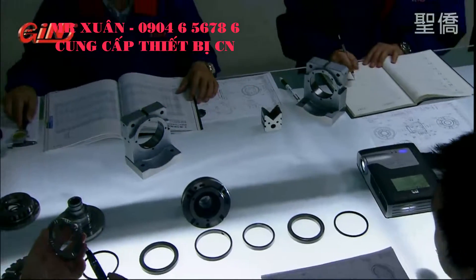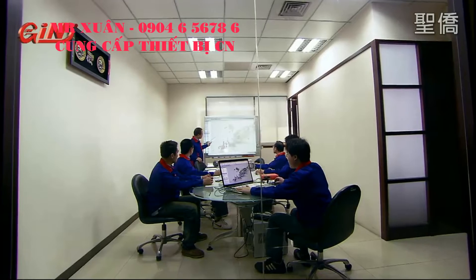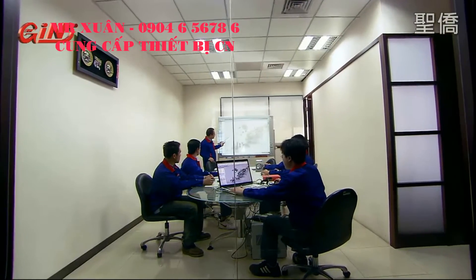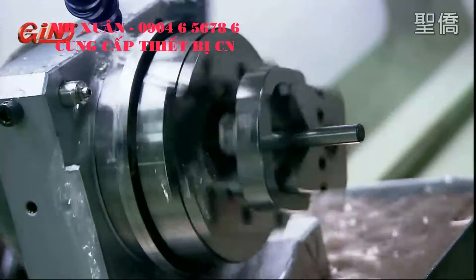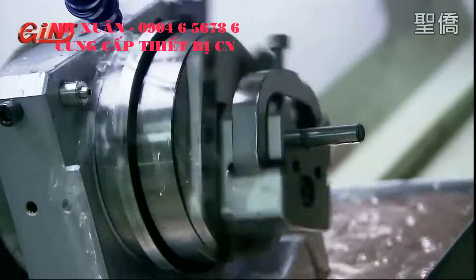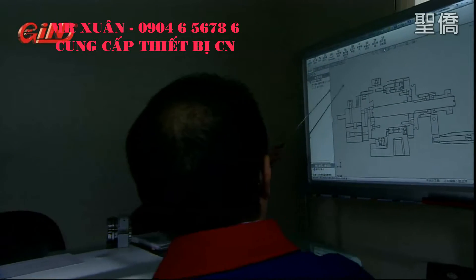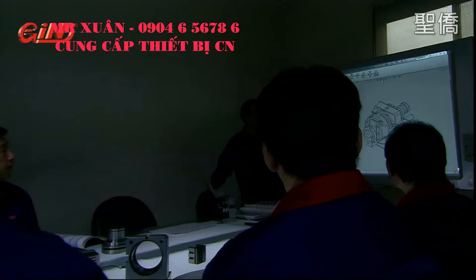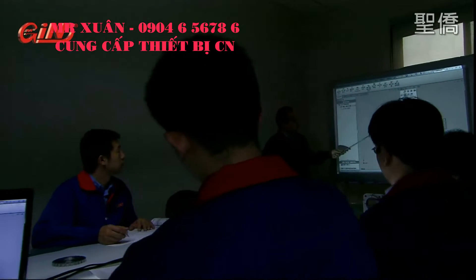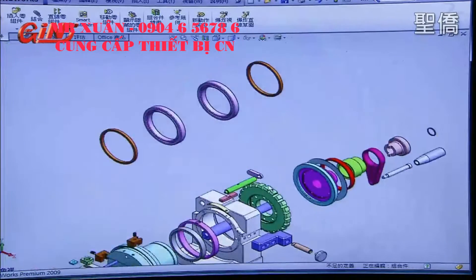With the experience and strength of the design team, they came up with a new design for an all-stainless-steel punchformer that would not only be able to handle tough new materials, but would also be waterproof and would extend service life by many times. The new punch design also featured two bearings rather than one and a completely sealed lubrication system that would not be affected by the high-volume coolants on modern machine tools.